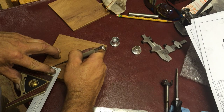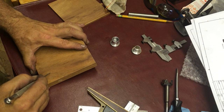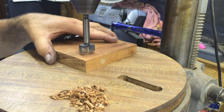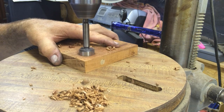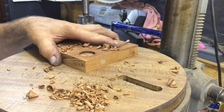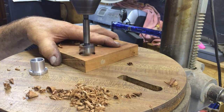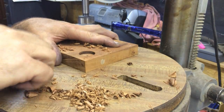I'm using a nice stair-step scriber — it works really great with wood and you can use it as a quick center punch. Now we're drilling the base out here with a one-inch Forstner bit, drilling it so the flange end of the hinge is just a little bit below the surface. Here I'm just testing the depth — it takes a few attempts to get the depth just right.